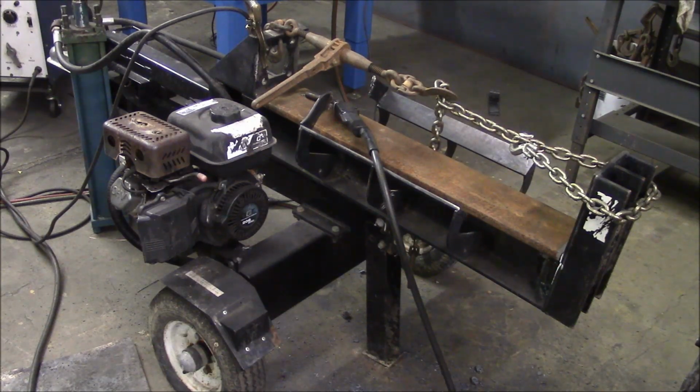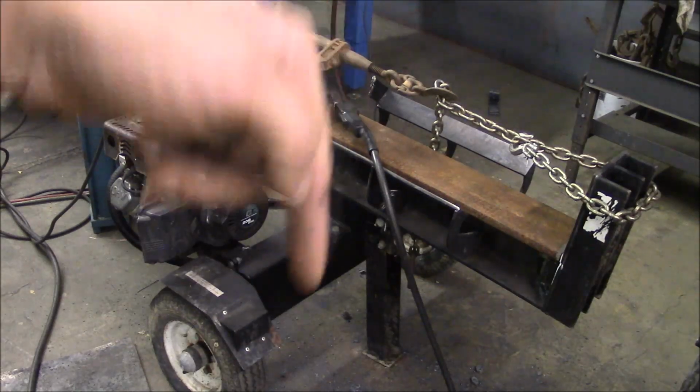So we're going to MIG weld this. I got the old Millermatic 200 out. We're going to be pushing her to the limit, I think. This is a 200 amp machine at, I don't know, 40% duty cycle or whatever they're rated at. And we're going to have to burn this in good and hot. And a little challenging because we're trying to weld a 3/8 thickness web to a 3/4 thickness top plate. So we'll have to see how it goes. Plus it's out of position. Probably I'll tip it up and weld it vertical down.